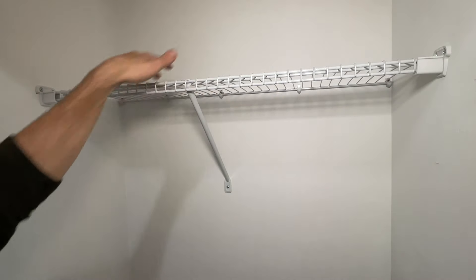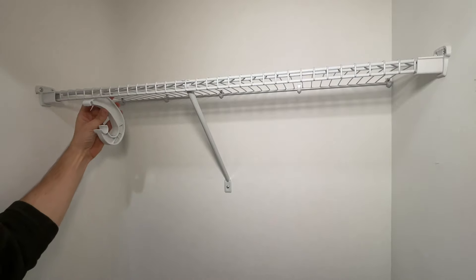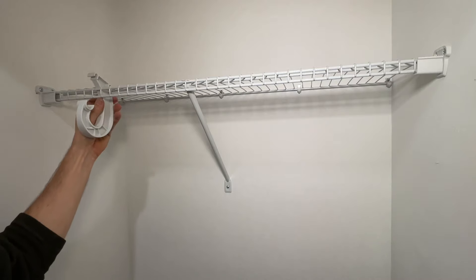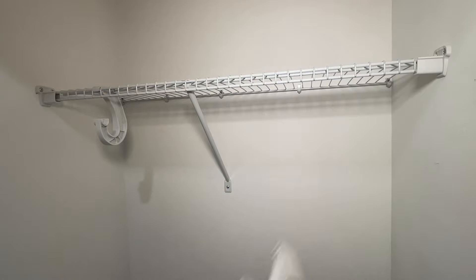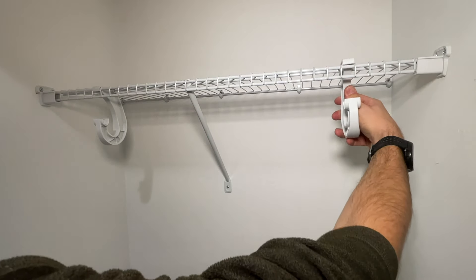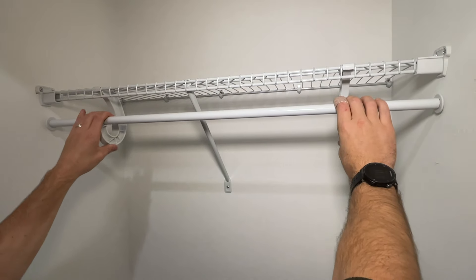The shelf is level and fully secure — very secure. Now we're going to install the brackets for the rod. I'm going to come in a little bit to make sure it has support, coming in four spaces and hooking up and over, sinking it in the back, then bringing it down. Same on the other side — taking four and going into the fifth. Then taking my rod with the end inserts in and pulling that into place.